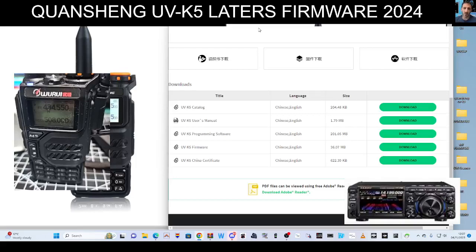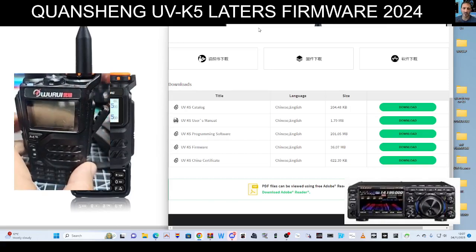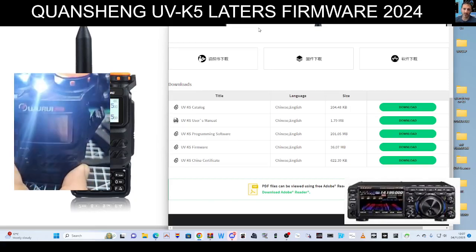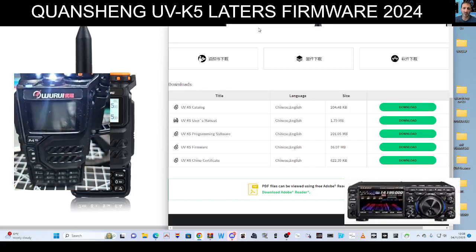Mzero FXP — let's download the latest firmware for the UVK5. It's nearly 2024, so get yourself into firmware mode. Just turn the radio off completely, unplug the cable, hold down the PTT and turn on, so we get the white light at the top. Now plug in the cable.